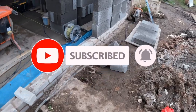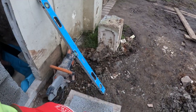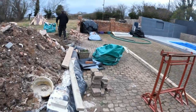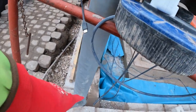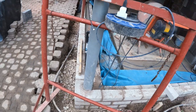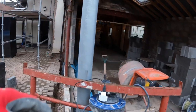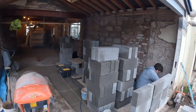It's all cuts. It's 270 cuts, so it's 270 with a brick and a brick, and then it's bonded. And then the front two are going to have a groove cut out of them. There's Jason heading off into the distance. I'm going to have to cut this one and cut this one to fit, which is a pain as usual, but it's only 8 courses. It's just to wrap around that so they have got something to fit the doors to. And that's going to be rendered as well, same as everything else.